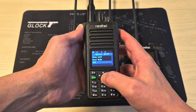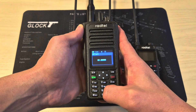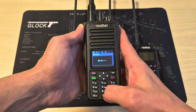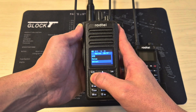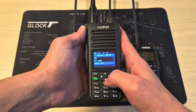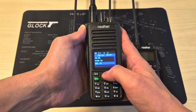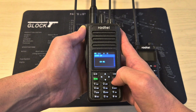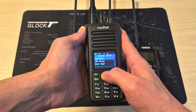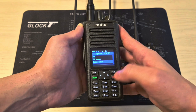Going further down in the menu: Scan Mode — you want to select Add so it will scan the channel. Offset is where you input your offset frequency for repeaters — for example, if the repeater offset was 0.5, you input 0.5 and click Menu to save. SD stands for Step Direction — that's where you select plus or minus. For most repeaters it's going to be a plus, so the offset will add 0.5 MHz. Then go to Store Channel, select the channel number where you want to store it, press Menu and it will save. Then go into channel mode from the main screen. When you go back to the menu, you'll be able to edit the channel name. After you're done, press OK and that's it.